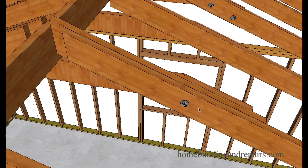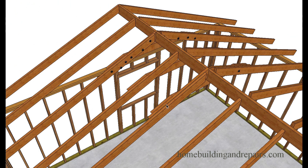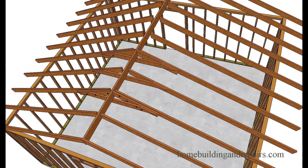If you're looking for a heavy-duty method, grab the bolts. If you think you can just put a collar tie in there, just nail a collar tie next to the rafter — go for it. If you think you can put the collar tie in next to an existing rafter and just put a bolt or a couple bolts in it, go for it. I'll leave it up to you.